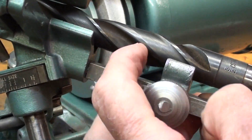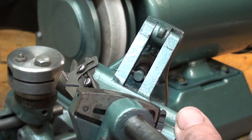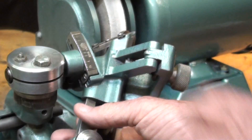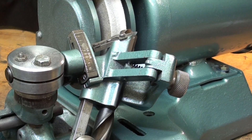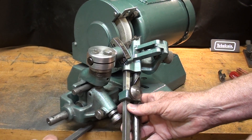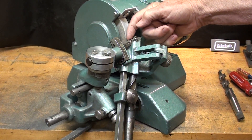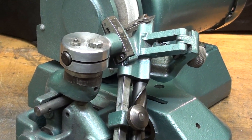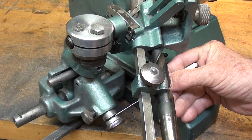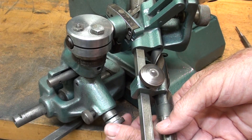The stop can be moved up against the tang - you may need to make an adjustment on the other v-block, but don't try to catch it on the taper; it needs to be somewhere on the flutes. The fixture is now ready to put into the machine. With the lever with the red handle, I can move the drill bit in or out, positioning it on the wheel without any risk of grinding the little guide into the wheel. The feed screw has a spring-loaded collar that can be locked with the thumb screw, but I won't lock it until I finish the first lip.